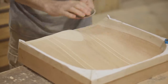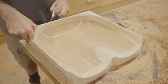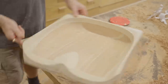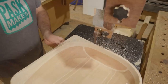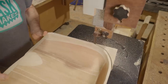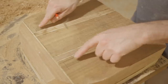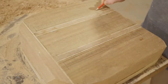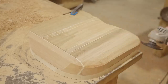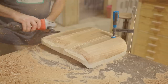I'm working away at it bit by bit and next I'll cut around the outside edge. Next I'll start carving the underneath and I've marked out two sections which will be the feet - I'll carve around those and leave them untouched. I haven't drilled any depth guides on the underneath; instead I'll remove the areas I know I can do so safely and then gradually refine it from there a bit at a time.